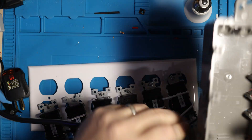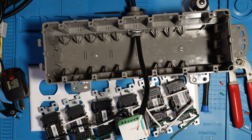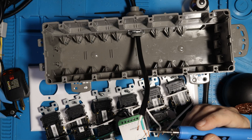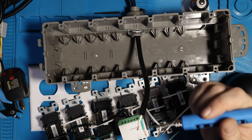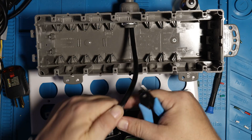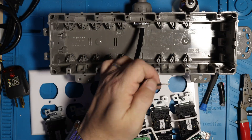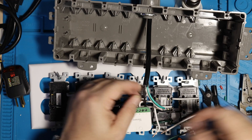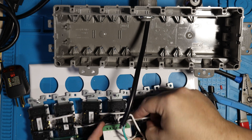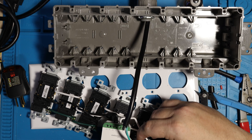Then it was time to add the neutral wire for the relay device. After that, I decided to add a half-inch conduit fitting for more cord protection. Next, I got to use my new toy — my soldering iron died and I decided to try out this cheap portable. So far it's been really good, although I'm a little hesitant to say that out loud too much. For more maneuverability, I cut the outer wire insulator down a bit more. Then I finally ran the hot from the cord to the L-terminal on the relay device, tied all the neutrals together with a Wago, and tied the ground to the cord with a Wago. I know you can't really see that here, but I didn't know I was out of frame and I'm not taking the thing apart again to reshoot.